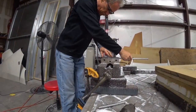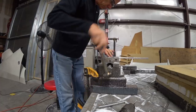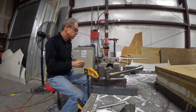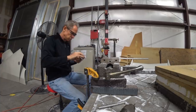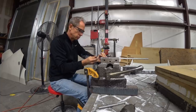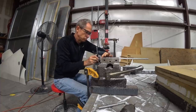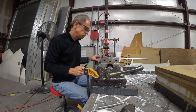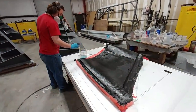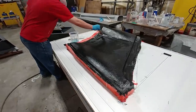Having drilled those rods out on the machine, the next thing was to tap the ends — a right-hand tap on one end and a left-hand tap on the other. It turned out I actually didn't have the left-hand tap; I thought we did but it may have gotten broken or lost. So I was able to do all the right-hand ones and had to wait until Tuesday for the left-hand taps to arrive.